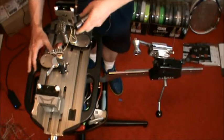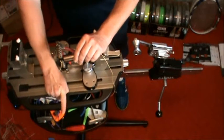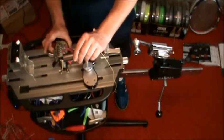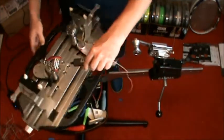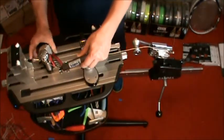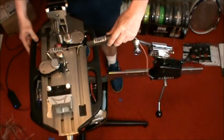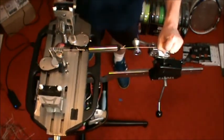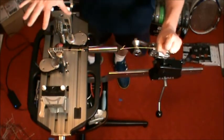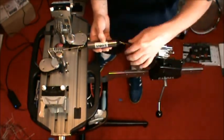And I'm going to take this base clamp and point this side of the base clamp in the direction of the anticipated pull, which is going to be this way. And I'm putting it in the dead center of the turntable as well, because if you lock this off center, you can see how the turntable is going to want to pivot. So you want to put this in the middle and lock it in place. This will naturally swivel to be straight. So now when you tension this, the turntable doesn't want to spin and swivel all over the place. And again, if you have a turntable lock, go ahead and lock it so that everything stays nice and still here. So that's the kilogram side, but if I rotate it around, we should be able to see the pounds.